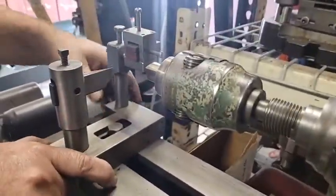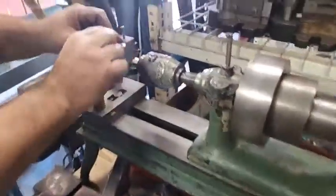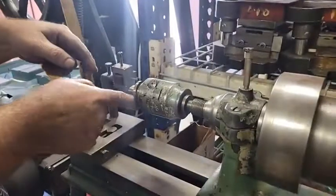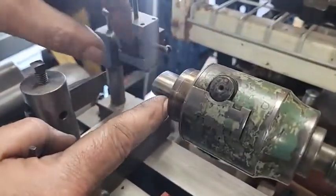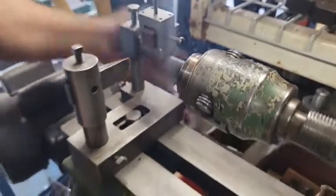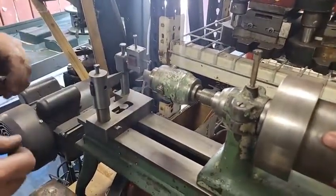So what this is, this is a jump ring making machine, and there's all different mandrels that fit in here, and these actually go the other way. So this spins, your wire goes on here, this little knife edge goes in there, and it spreads — it just forces the coils off of this. This actually needs to be moved over, nothing's set up, but you could knock out thousands of jump rings.